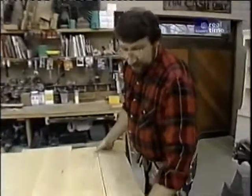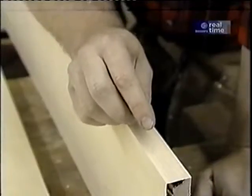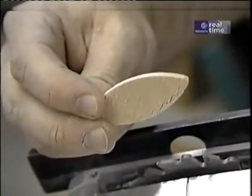Now I'll look at the joints. If we look at this one, we see that it rocks, and I don't want to have to apply pressure to pull these boards together — I want them to fit without any pressure at all. So I'm going to have to join each edge. With joining complete, I'm ready to assemble the top. Maple is a real hardwood and doesn't absorb glue into its pores like a softwood does. So to strengthen the joints, traditionally dowels were used, but today the technology has changed and we use biscuit joining. It involves a tool with a small blade that cuts a half-moon in the edge of the board, and these biscuits, which act like a spline. Because they're beech, they'll absorb a little bit of moisture and when they swell up, you'll never pull the joint apart.